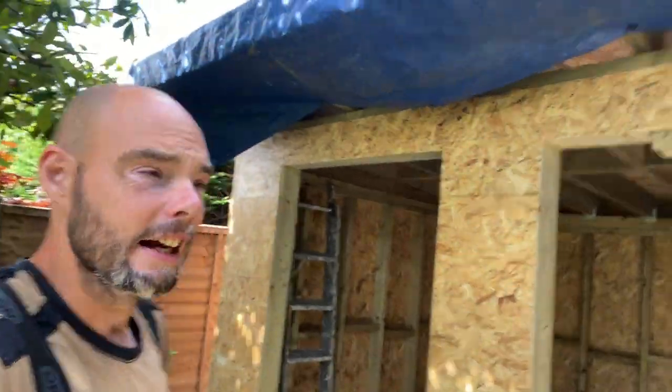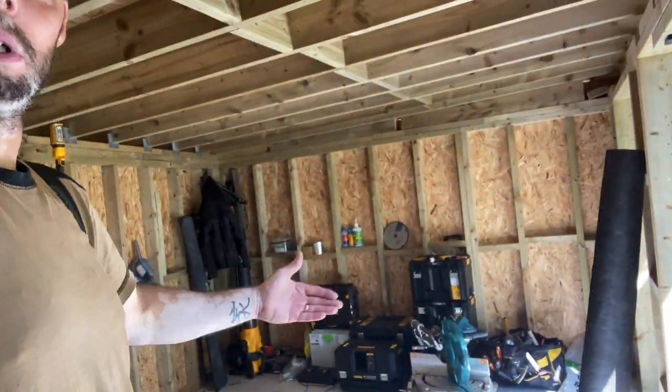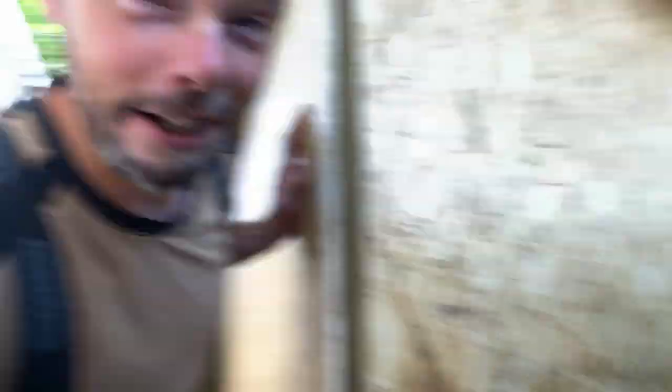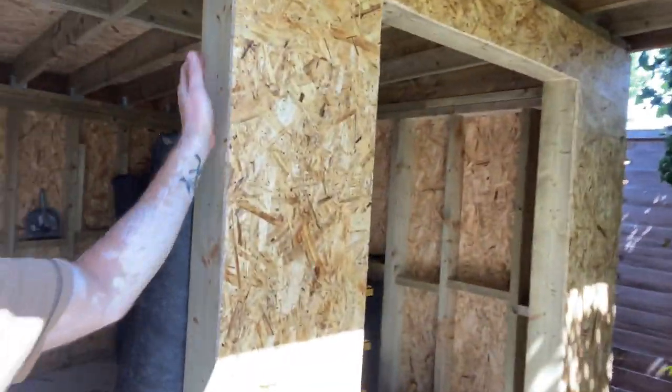Right - it's official, I've moved in now! I've covered the roof over with tarp because the rubber isn't here, so even if it turns up I won't get a chance to glue it today. I've had a nice clear up of the site, all my stuff is now inside, I've built myself a little workshop - I like this intermediary part, I've got somewhere to work and can stay dry. Now I'm putting on the breathable membrane. I've got a partially used roll here and another one ready - it's a different brand but exactly the same stuff, doesn't make a difference. This gets wrapped on the outside of the building, all the way around.